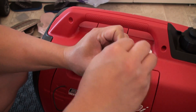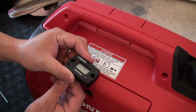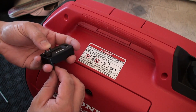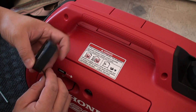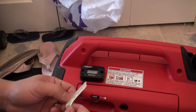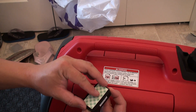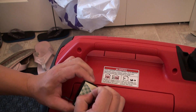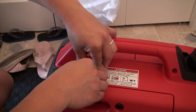Do the same cleaning on the back side of the hour meter. Next, take the sensing wire and pass it through the underside of the hour meter, then poke it into the corresponding hole. While holding it with your thumb, pull the excess back into the underside of the meter — there's a notch cut out on the bottom or side for proper cable routing. Peel the adhesive backing off the double-sided tape, attach it to the back of the hour meter, then peel the opposite backing and carefully attach it to the generator housing, giving it a firm push.